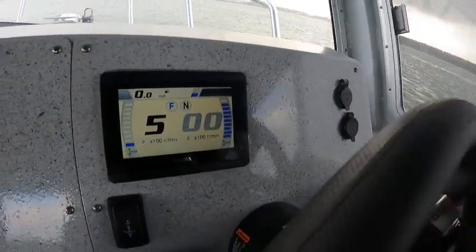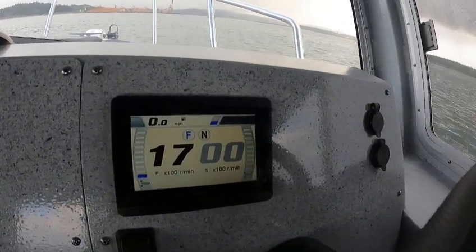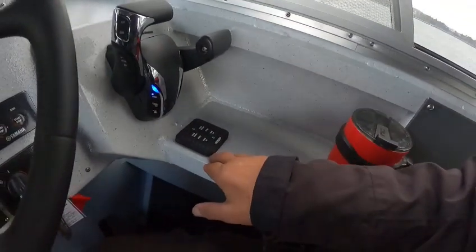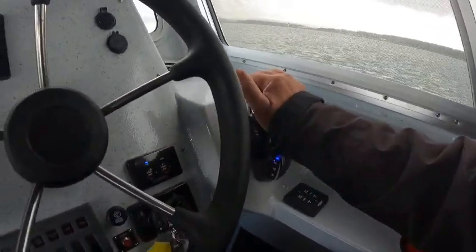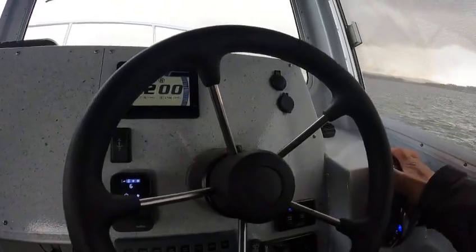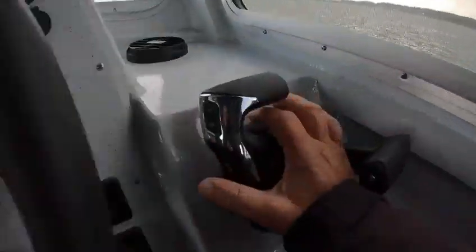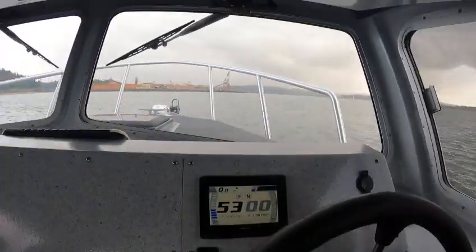Make sure it's on dual lever — don't go to single lever. When it starts blinking that means you're high enough. Now on this motor I want to make sure it's trimmed down — you don't even need the trim tabs here. Look how fast this thing gets up; I've barely given it any gas. We're already going at 5300 — max power here — and I know I'm up on top. I'm going to start trimming the motor up, then use the other control to straighten it. I can feel the boat taking off — this is one motor.